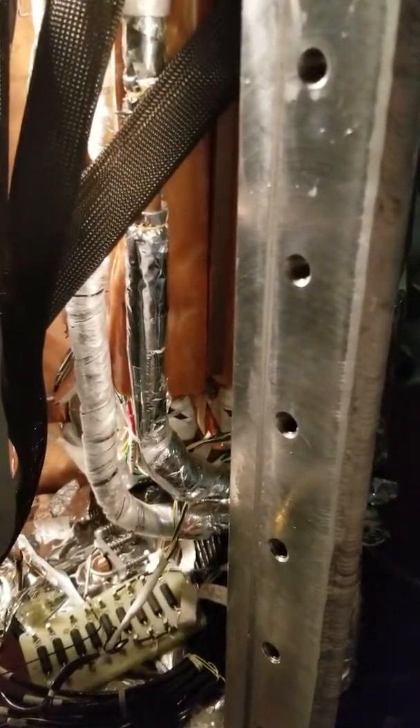This is probably metric up to at least here. These two tubes I made and bent around like that to make the connections. They had a coupling here - that might be your transition point. I'm going to come down below - I'm not going to try to unsweat that. If I cut it down here, I'm going to cut one here and maybe one here. These are good candidate places. Then this one I'll cut over here, and you'll carefully heat-shield and re-sweat couplings on when it goes back.